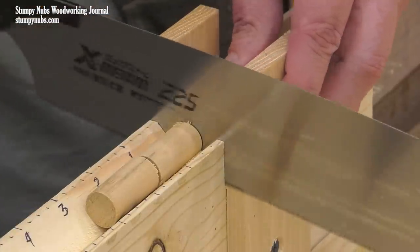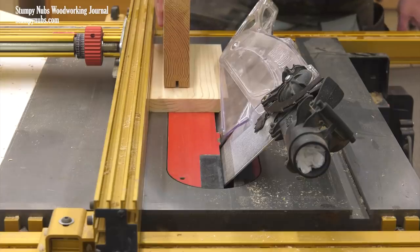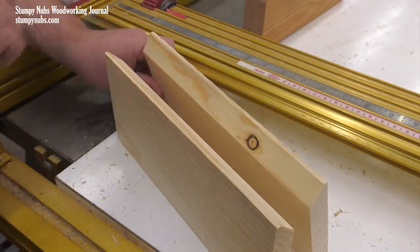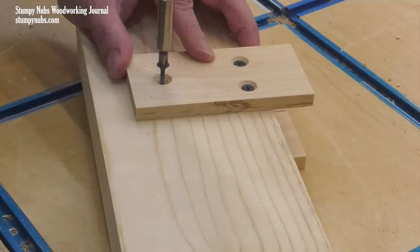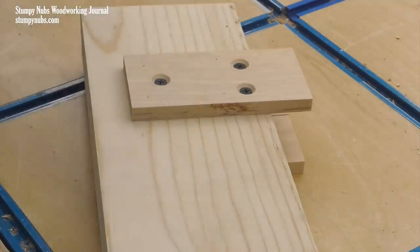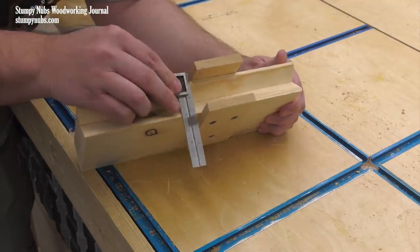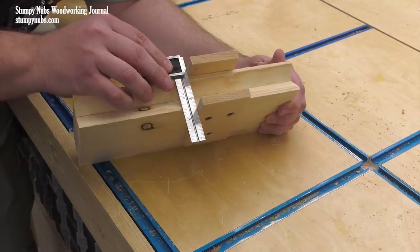I adapted this dowel cutting jig from something I saw in a woodworking magazine years ago. I made it by cutting 45-degree bevels along the edges of two pieces of wood, leaving just a little narrow flat. Then I sandwiched the two pieces together. I screwed a little scrap of wood on each face so they stand up about an inch and a half above the beveled edges and fall about an inch short of the opposite edges. I made sure both were plumb and even with each other, because these will serve as guides for making square cuts.